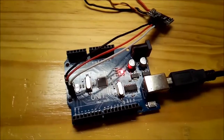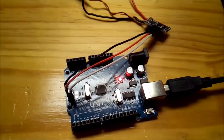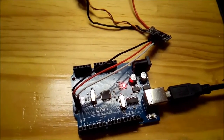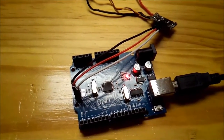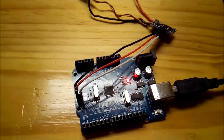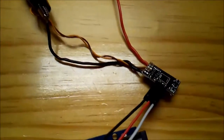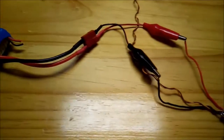As you can see, we have everything connected up. Arduino is connected through the USB to the PC. The Arduino has already been flashed with the BL-Heli Programmer, the 4-Way C2 interface, connected to the ESC. And the ESC is powered from a LiPo.